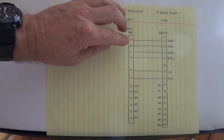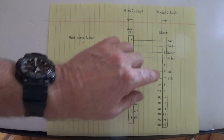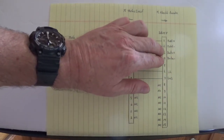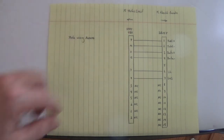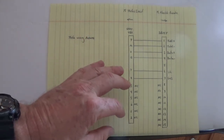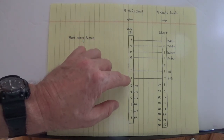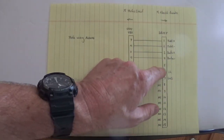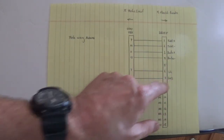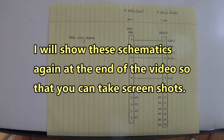That's your transmit requests of 1 megahertz on and off. The data from the serial absolute encoder, data plus and data minus, come from pin 3 and 4 back into the tester circuit on TB1 pins 11 and 12. To power up the encoder, I put 15 volts on pin 7 and its ground on 8, and that gets routed out to the serial absolute encoder on pin 6, UB, and 7, ground. That's the tester. Let's go do the test.